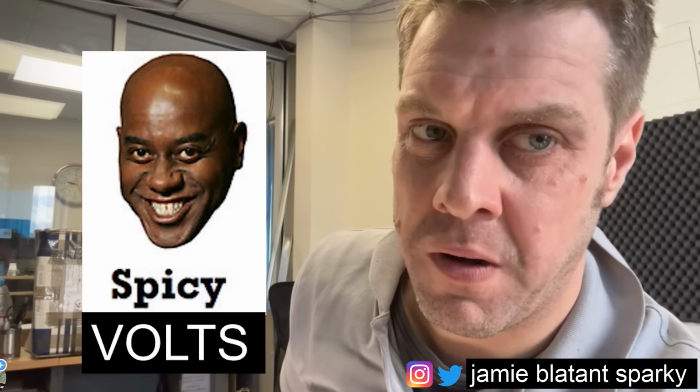Just be aware, not everyone does that test. Not everyone teaches that test. It's just something I like to do to prove, stop beeping meter, I'll turn you off. I like to just prove that each end of the windings is not connected to earth and each end of the windings is not connected to each other. Because if you've got a little fault, it'll just show up there anyway. But you need to get spicy with the mega to prove it.